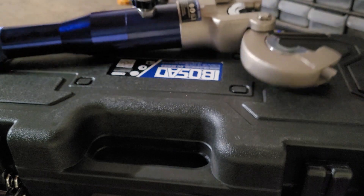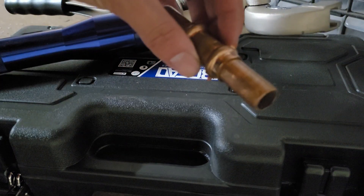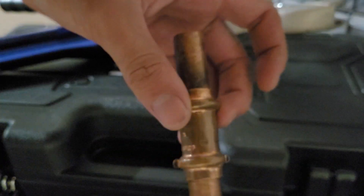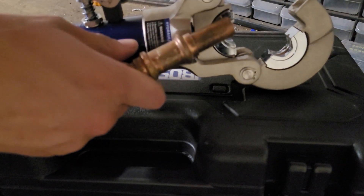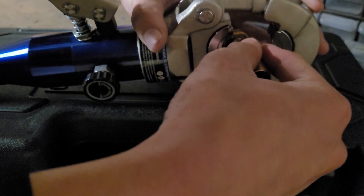As you can see, it has been crimped on pretty tightly — no way that's going to leak. Now let's crimp the other side. You just tighten the loosening knob. That loosening knob basically retracts the tool by releasing the hydraulic pressure. And now we can crimp again.